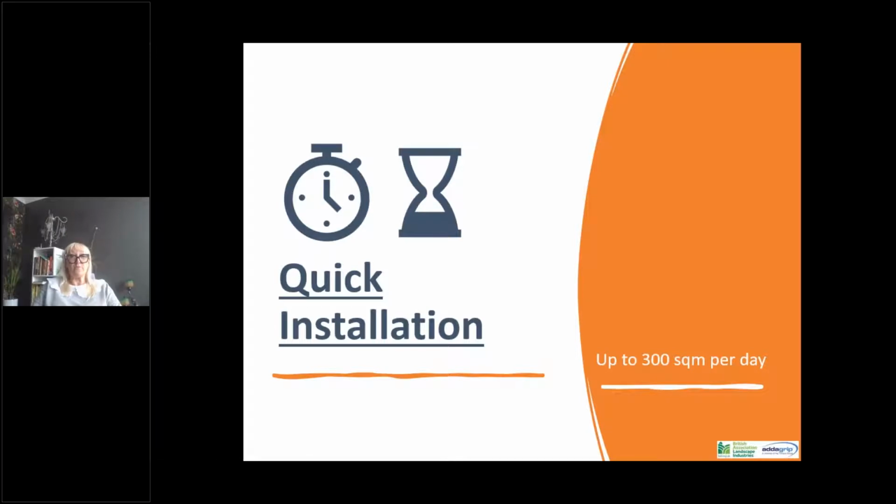It's also, from the point of installation, a very quick installation. A team of 3 or 4 can do up to 300 square meters a day, so you get a much quicker installation than you would, say, from block paving. It's also very quick to traffic afterwards. You can traffic it within 24 hours of the install.